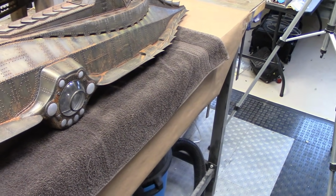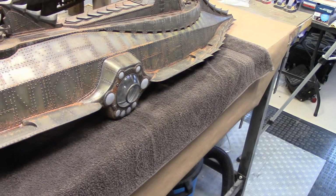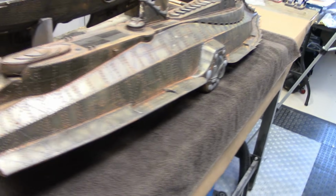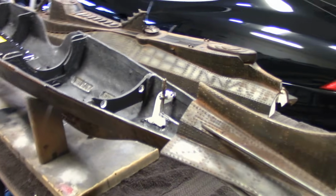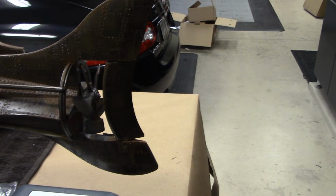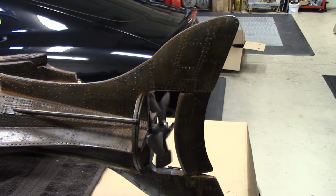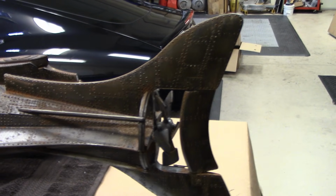They are too small, placed too close to the center of the boat in order to affect a reasonable pitching moment about the center axis of the boat. And I learned that during the time that I scratch built my very first Nautilus. And so the solution that I came up with was to actually pitch the entire propeller. And as you saw there, basically there's an arm, and that prop is gimbaled, and there's a universal shaft inside that allows it to spin while it tilts there.